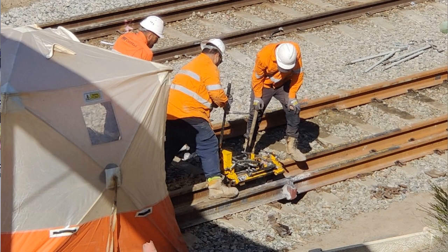Once you've done this, basically there's like a hydraulic ram system with like a big cutting thing that you smash off the mold, and then you run this hydraulic ram while it's hand pumped, while everything is still red hot, and it just cuts away the excess, or most of the excess, and then you run a grinding machine over the top of the whole weld to smooth it out, and your wheel hammering has gone away. The other thing about doing this is, for some inexplicable reason, this actually helps deal with the track expansion problem to some degree as well.